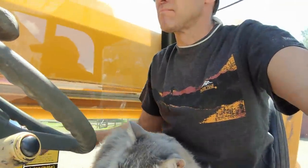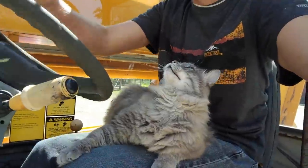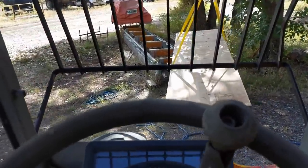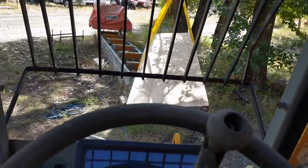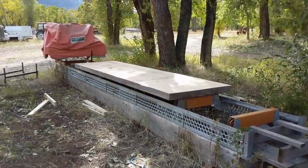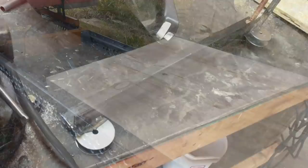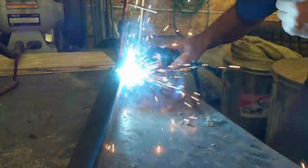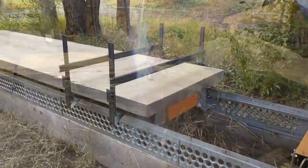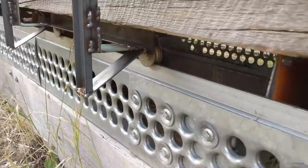We needed to find a very even surface, so we used table rails from our sawmill. We fabricated an attachment to hold our 7-inch planer. The rails worked as a guide, and with some testing and engineering, our device was ready.